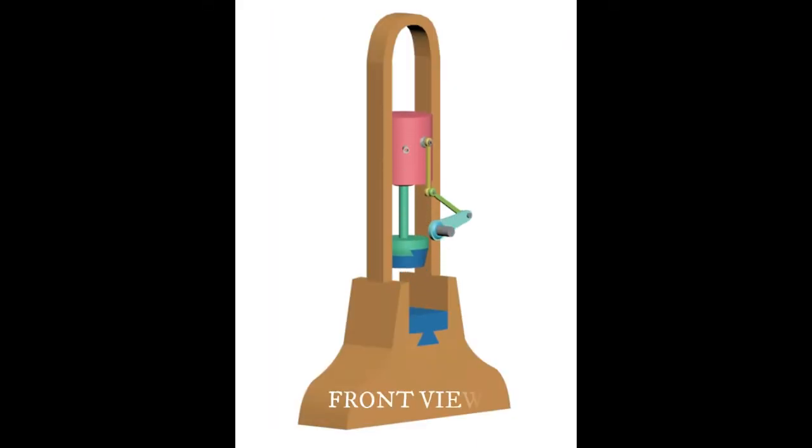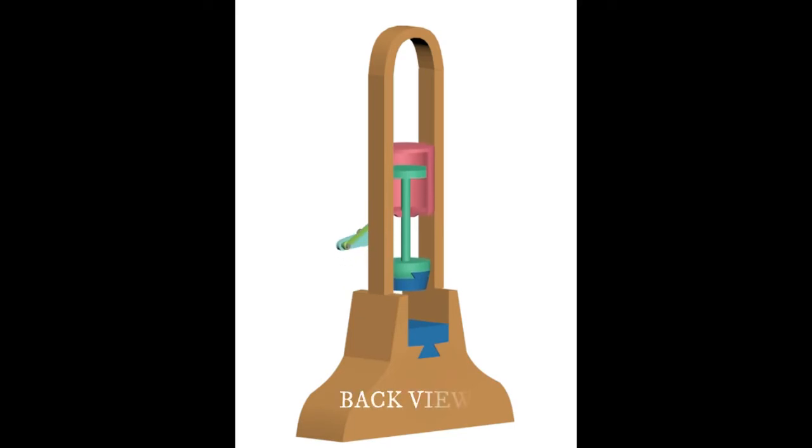Hammerhead C is attached to a piston fitted to a cylinder B, which is connected by a rod D with a crank on the rotary driving shaft. As the cylinder ascends, air entering hole E is compressed below the piston and lifts the hammer. As the cylinder descends, air entering hole E is compressed above and is stored up to produce the blow by its instant expansion after the crank and connecting rod turn bottom center.